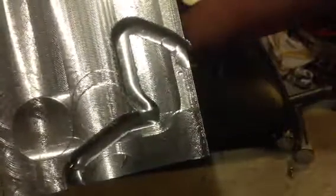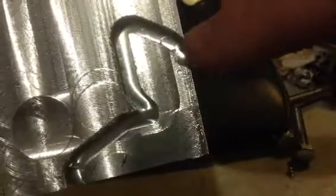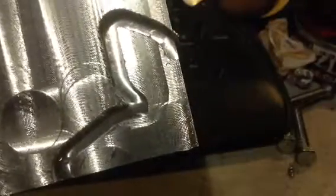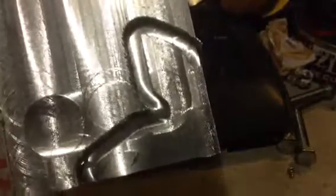I made so many mistakes, but I can't believe this mill is really powerful. The first dive into the aluminum was 200 thousandths and I almost hit the e-stop because I thought I was going to snap that bit. It didn't snap at all — it was a slow feed rate so it just plunged in and knocked out all of that, but I didn't go deep enough so I've got to check that out.